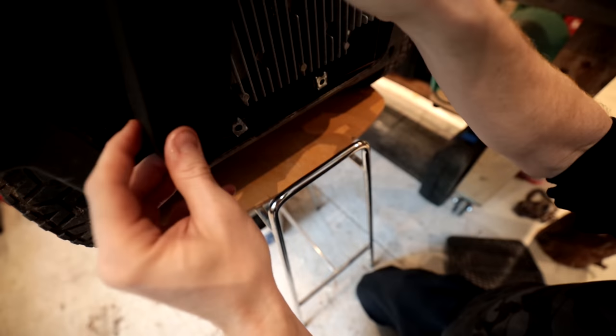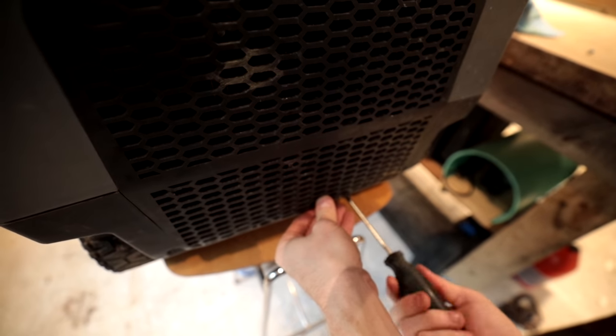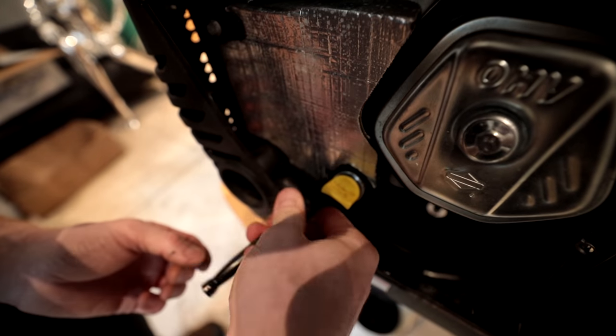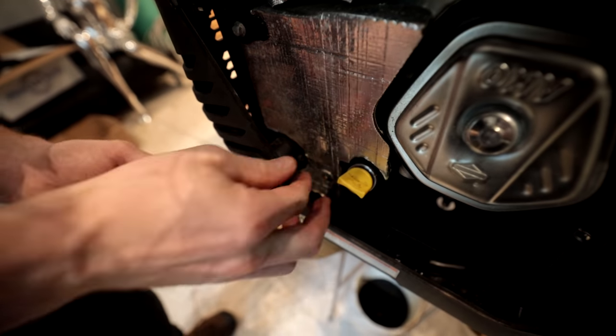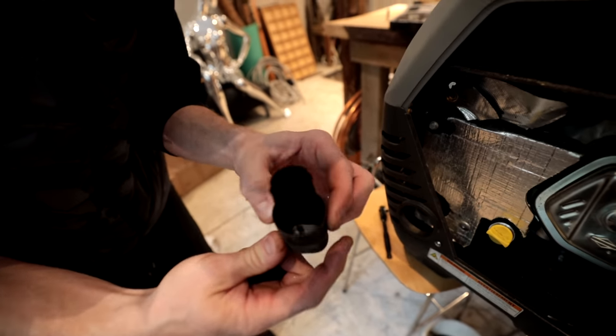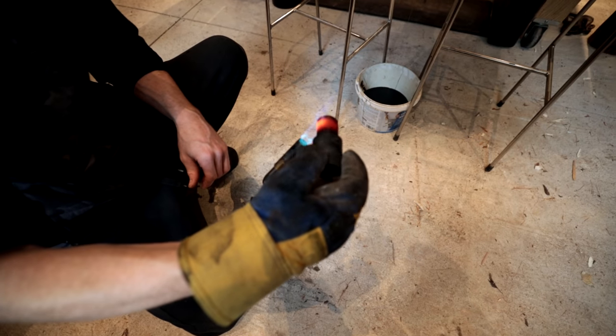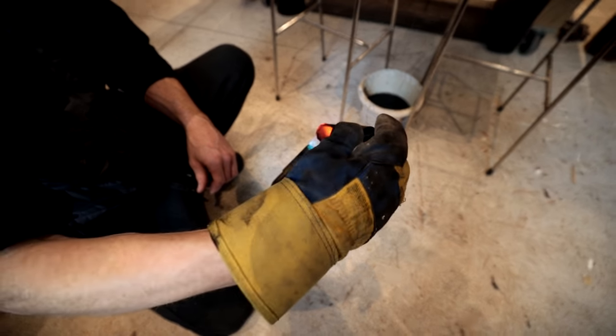Make sure our machines are working properly. I have very limited knowledge when it comes to small engines, but I do know that a common problem for small engines not working is the spark arrestor. It's just a screen that catches sparks coming out the back to prevent forest fires. Most small engines have them — chainsaws, whippersnippers. Sometimes the engine starts but doesn't have enough oomph because the exhaust isn't getting out of the muffler. You take it apart, you can see carbon buildup. Use a torch to burn it off, and your engine works like brand new.